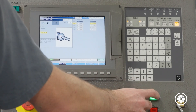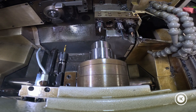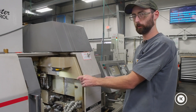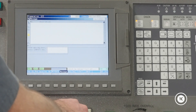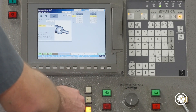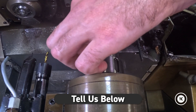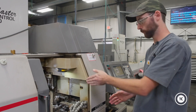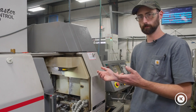We're going to go man set, longitude, push and hold cycle start because that's what this machine wants. With my feed rate fairly up, it came over and came forward — still well back from our tool. Now we can use the handwheel to jog it in and touch it off. I'm going to turn on interference invalid because this tool is set so short that the sub-spindle is going to have to enter the no-fly zone around the tooling. If you don't have this on, you'll get to a certain point and it will throw an interference alarm. Just back it up, make the alarm go away, then select interference invalid and you can jog without throwing an alarm. We'll take our piece of paper and just touch it off — there we go, it grabs. That's zero for that tool. We have our value, we hit input, it applies that value to your longitude, and that tool is set.